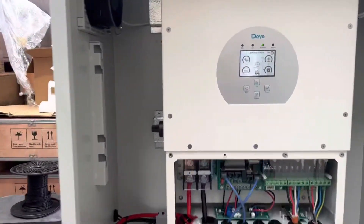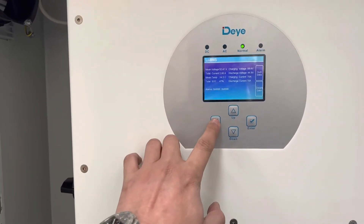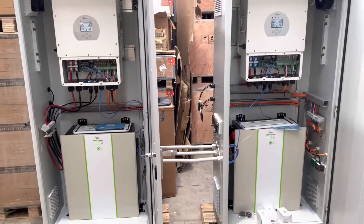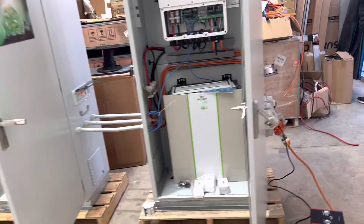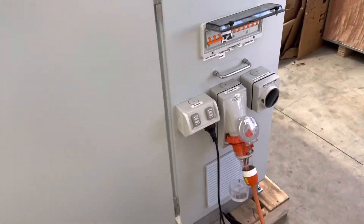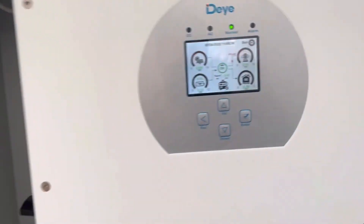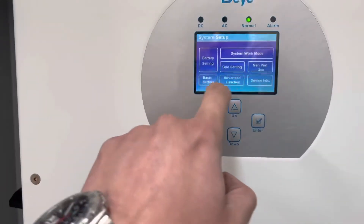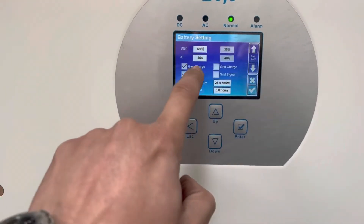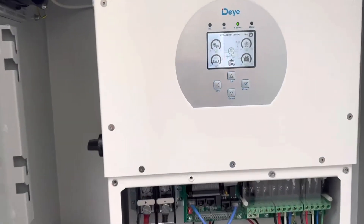As you can see from the cabinet, the inverter reads the battery BMS. We're going to simulate charging and discharging now, so just put a three-phase generator on here. Inverter charging will kick in in a second — I set the charging to 40 amps, 40 amps each battery. And now it kicks on.